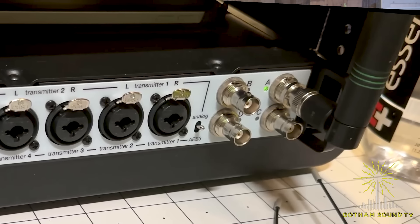And then this is very intriguing, and I think we're going to spend the bulk of our time going over this. I assume those are RF outputs? Correct. The unit I brought is a quad — we also offer a dual — but think of this unit as a quad in the fact that yes, it does four stereo channels. However, it can generate four RF frequencies out of these BNC outputs. This will be more prevalent as we talk about WMAS as well as some other new techniques you can do with these BNC outputs.